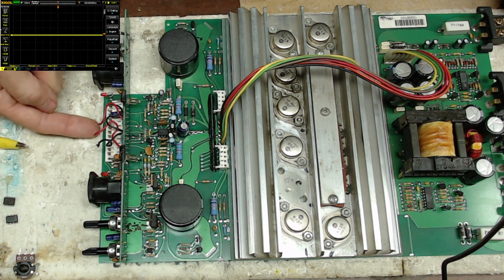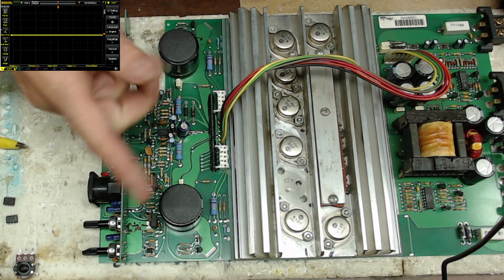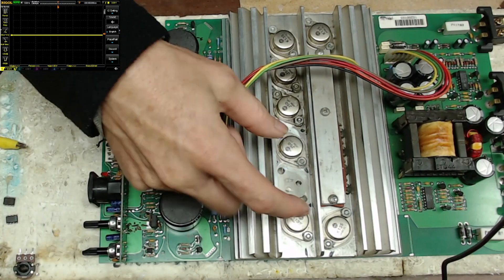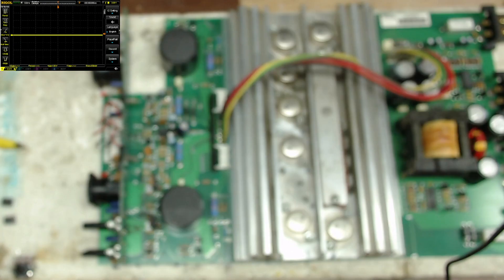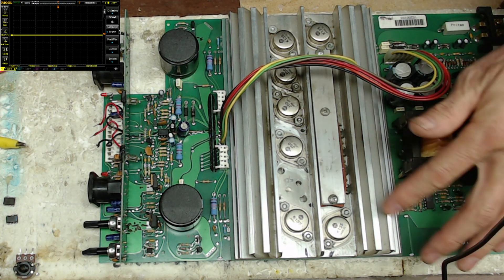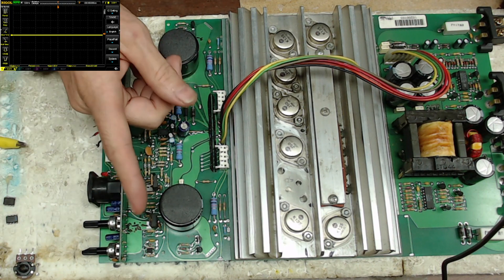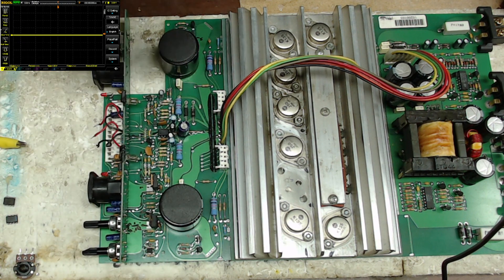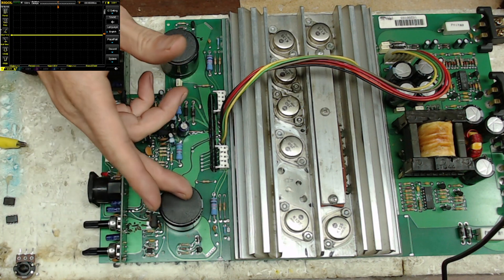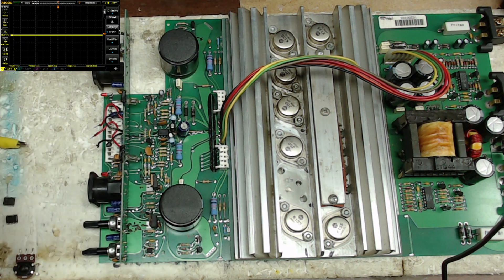It did have a little burnt trace at one point — it looked like it had a short on the RCA inputs — but I got that all glued back down, solid as a rock. This board is good to go minus the missing transistor; I need to ask the owner what he'd like me to do since these are in parallel. Otherwise it's straightforward — similar to a TL494 switching power supply, push-pull, some rectifiers, two capacitors, two 6L6 tubes making a good Class AB amplifier. Thanks for watching — leave any questions below and I'll get to them as soon as I can.